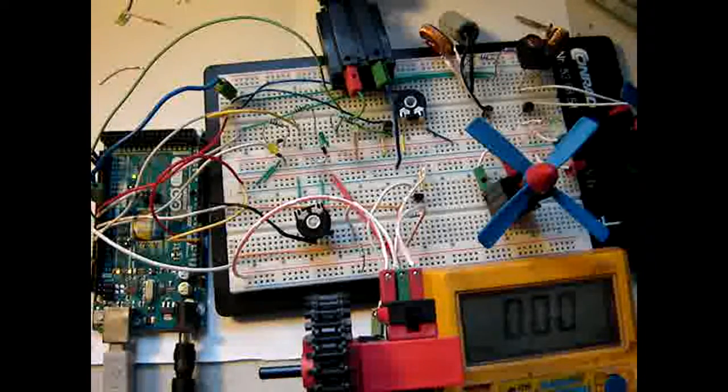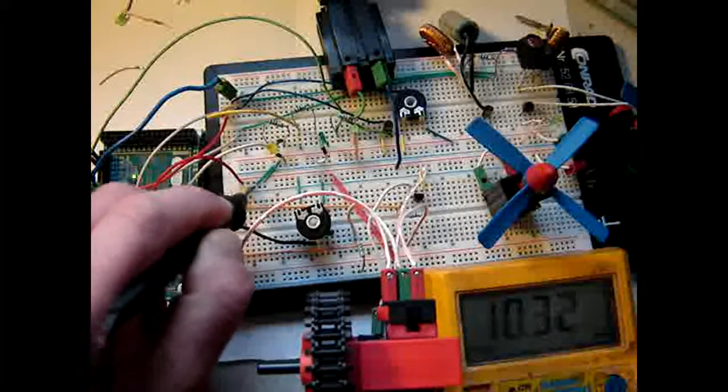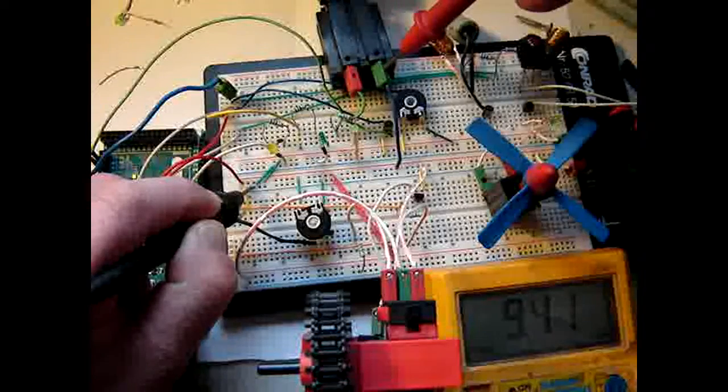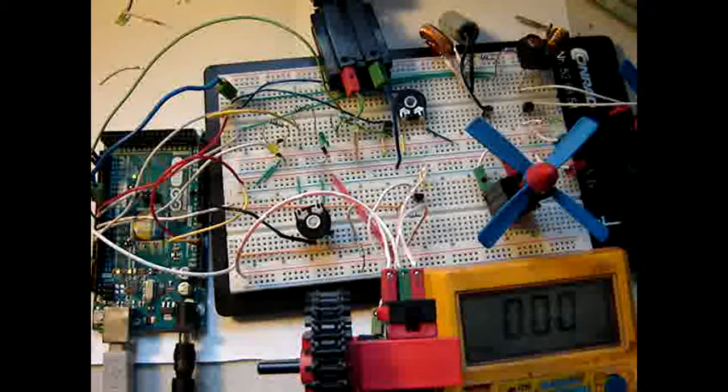The point is that these motors, fischertechnik motors, have a frequency in the range of 40 Hz to 120 Hz, and that is something that matters with these motors. So when I measure, for instance, here on the mass, and I check for instance here, I have a frequency of say 7.5 kHz, which is pretty high, and not in the range of that 40 to 120 Hz.